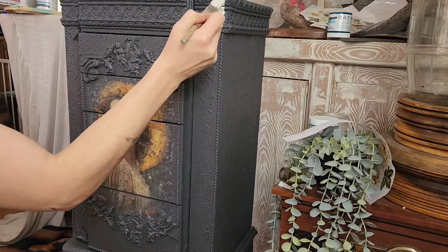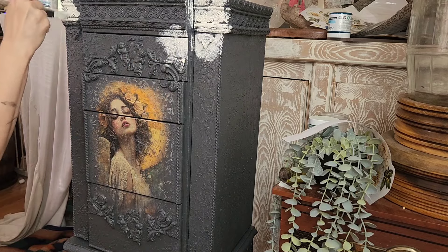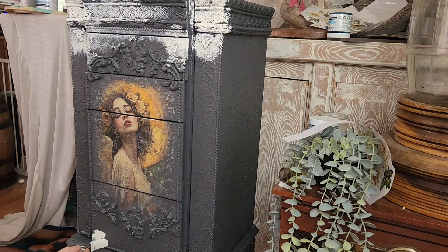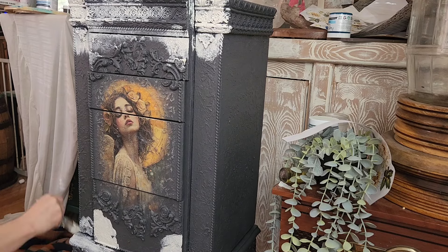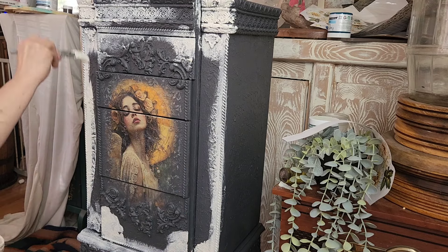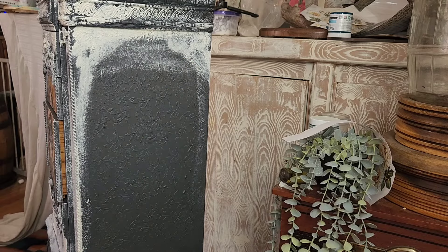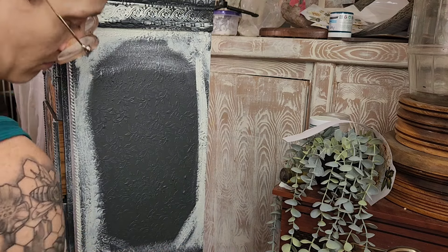Next up we're going to add some areas of white to this jewelry armoire, again using Italian Ivory. I want to add this color mainly on the corners and on some areas on the outside of the trim, because my inspiration behind this design is an aged copper penny and I have seen some that have that kind of white powdery type of age mixed in with the greens. That's what I'm trying to mimic here with this Italian Ivory paint. The real trick for me to achieve an aged paint look is to toggle back and forth between adding layers of dark and light paint, so bear with me because this piece is going to be getting quite a few distressed layers of paint to achieve that weathered copper inspired patina look.